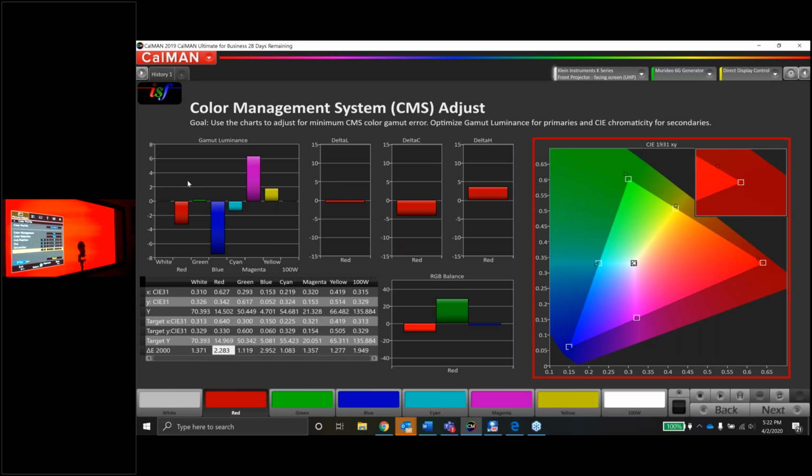And you'll notice the delta L graph. This graph measures the luminance error. So as we get to our correct value over here, the delta also zeroes out. The delta tells you how wrong it is. Right? So if it's correct, then there's no delta error. If it's way off, then there's a big delta error, right? So this is at 0, this is at 0, red luminance is fixed. That was super easy. Now maybe, just maybe, we can get the dot in the hole.